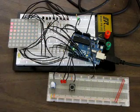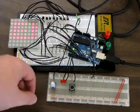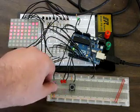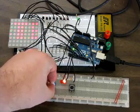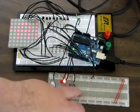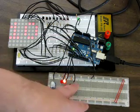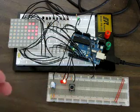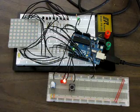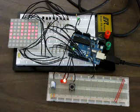This will be a rotary encoder, which will not reset the pad number on there. And this will be, of course, replaced by a 7-segment LED. Let's go to pad 3. Another function is that I can actually interrupt these messages anytime and go straight to, now skip to the countdown. Another thing is the abort. So in the middle of the countdown, you can abort the countdown because you probably want to do that at some point. So now the countdown is aborted, and then we could go back to the initial launch state.